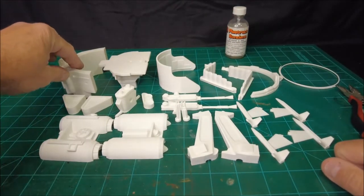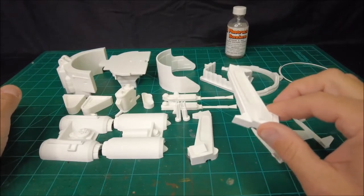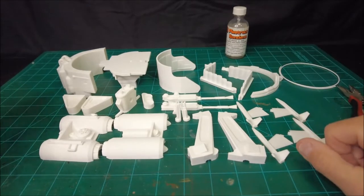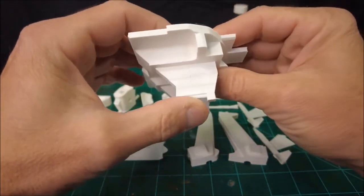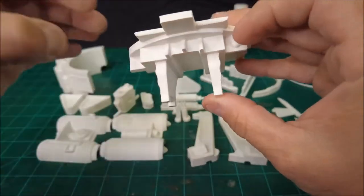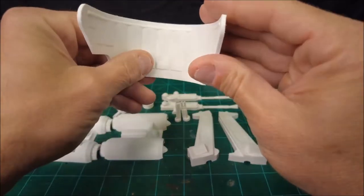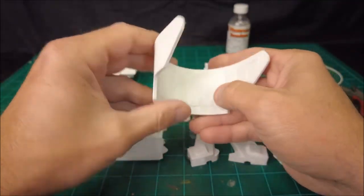About the 3D printing process for these parts. For this particular copy that I'm producing, these are all printed in PLA plastic. You can print in ABS, PETG, PLA, basically whatever kind of plastic you're comfortable printing in. But PLA works just fine. I used a 100 micron, or 0.1 millimeter, layer height for all of these parts, which gives me a pretty fine layer height and makes the layer lines pretty low key. They're not invisible, but they're not super obvious. If you go with a taller, thicker layer height than 100 microns, they're going to be much more obvious. You're also not going to get as high resolution a finish on the various shapes, contours, and details.